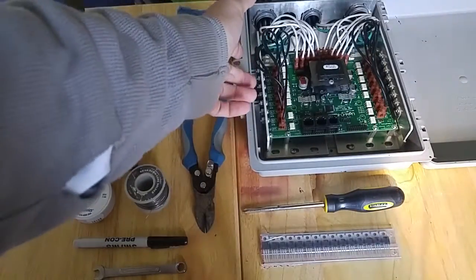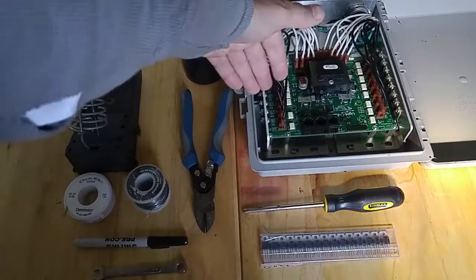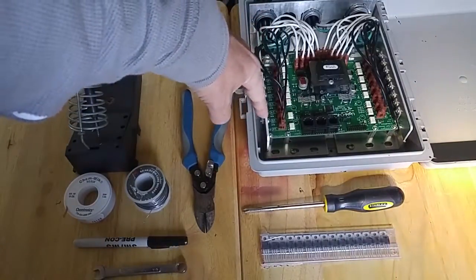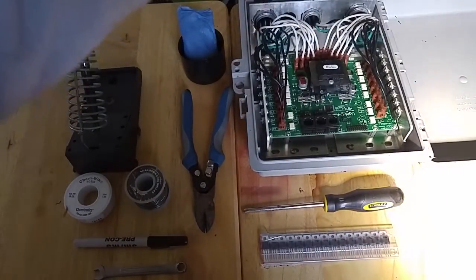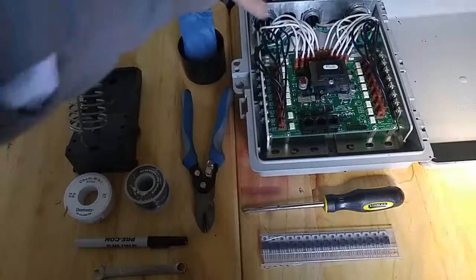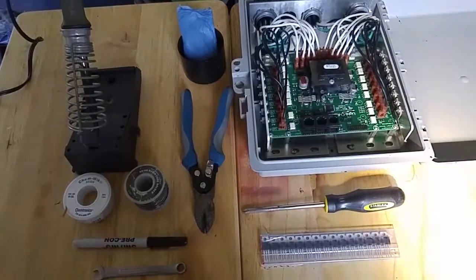Basically what happens is these ICs have been overdriven over the years. Once that happens, these ICs start leaking. The IC doesn't turn completely off, so it leaks and there's still power going through the wire out to your light — your lights are barely on, or sometimes maybe 50-60% light going to your strand even though everything else is turned off. Other times the light strand is completely on and won't go off. Even if it flashes between songs, that light strand stays lit the whole time after the song is played.